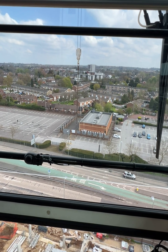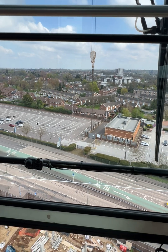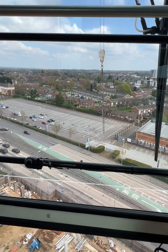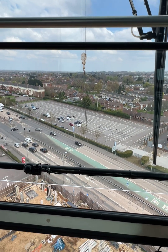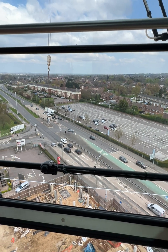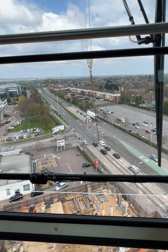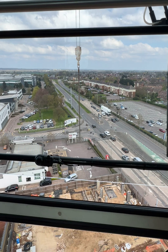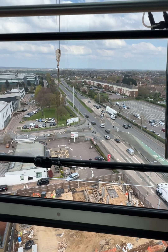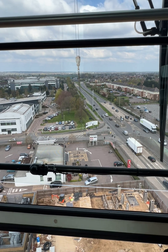Say you didn't take into consideration your stopping distance — you're swinging in fourth gear and your load is flying all over the place. You go into third gear. Once you keep your eye on the hook block, you can see it going. I was in fourth gear trying to catch up with it, and there might be a little swing still. You catch that in second or third gear, because that's the gear in which the swing was created.